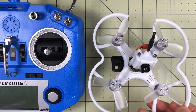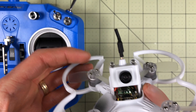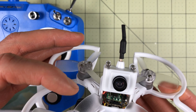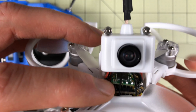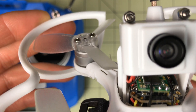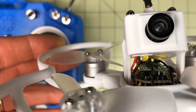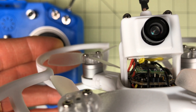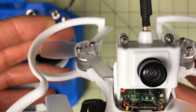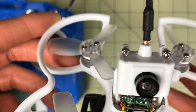This video is to get an XM Plus receiver installed inside the Babyhawk. I've seen some other videos where people have done it really weirdly — they've de-pinned it, they've wired onto the pins — but what I have done here is directly soldered the XM Plus to the pins on the board. In order to do that I had to fan them out into a W or trident shape. They didn't fit all the way down but I got them over and soldered on. Each of the three pins are soldered on and it works pretty well.